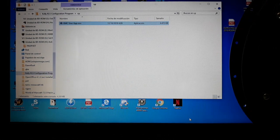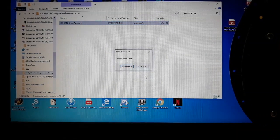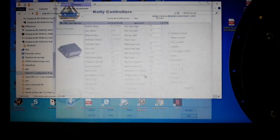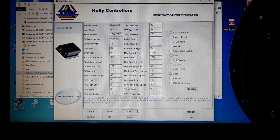You can notice that the motor makes little noises and turns during the procedure. Now the three minutes have passed. We disconnect the battery from the controller, wait a few seconds, then reconnect the battery and the starting pin. We open the configuration program again — sometimes it fails and we have to try again. We do a Read and check that the identification angle value, where we wrote 170, is back to 85. That means the identification angle procedure has been completed successfully.